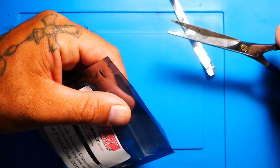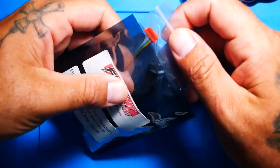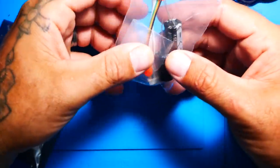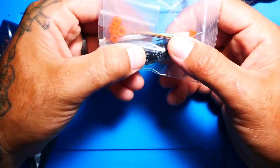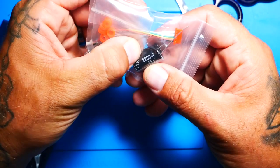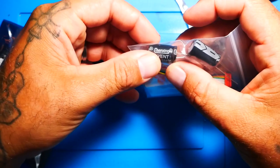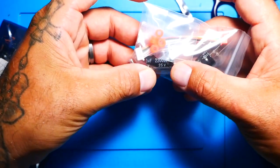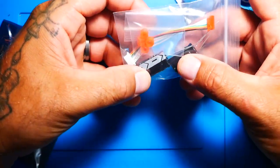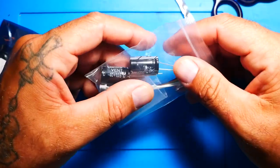Right off the bat, we've got a bag with our capacitors. We've got two very large capacitors — these are 25 volt, 2200 microfarad capacitors. This is a very large capacitor. The Afterburner came with 1000 microfarads at 35 volts, so that's the difference between the two. These are much bigger because this ESC is expected to do a lot more work than the other one.